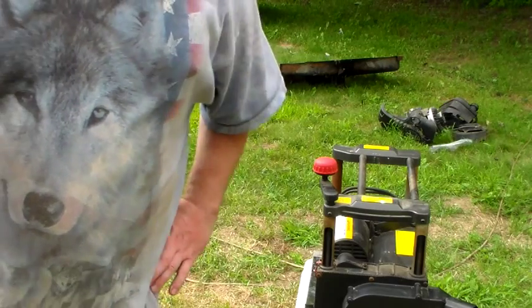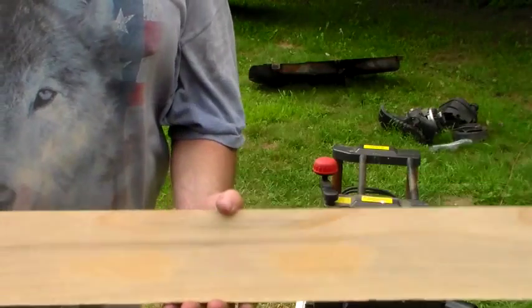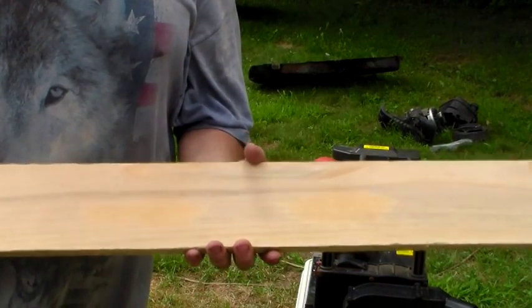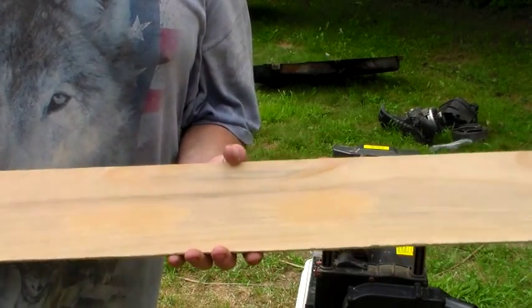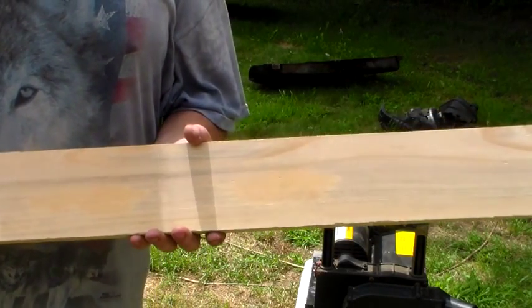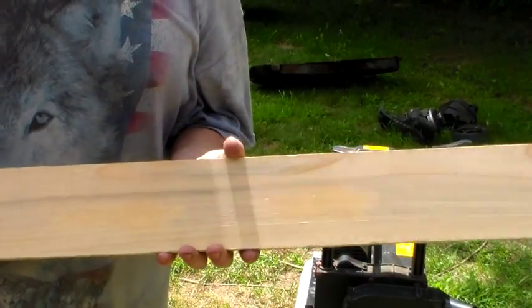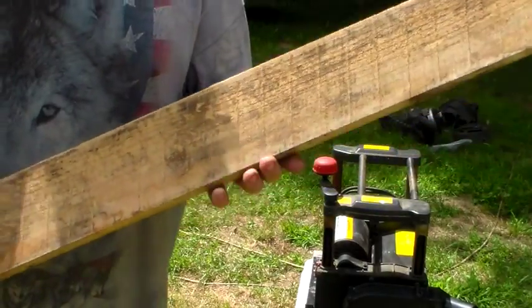This is just a quick video showing you what you can find underneath the surface on the wood. Now if you're using packing wood and stuff like that, make sure you've got all the nails and any little screws out of it before you run it through, because you can ruin a blade on a planer real fast — don't ask me how I know this. We'll talk to you later. That's it for today.